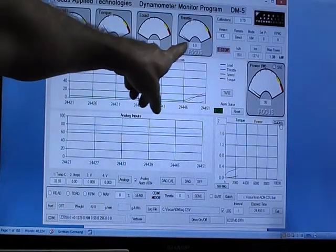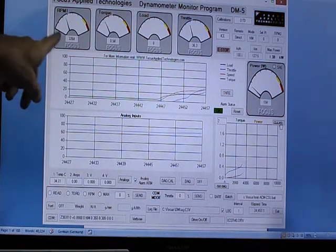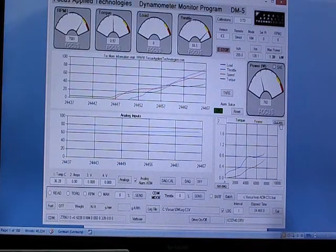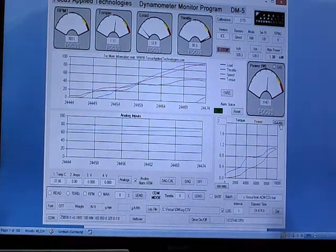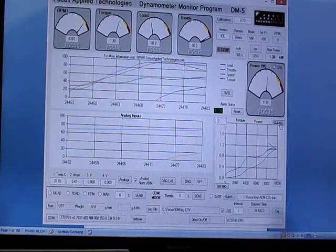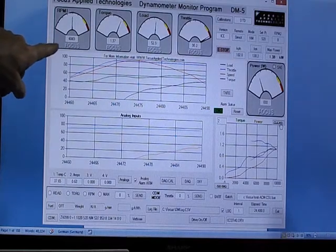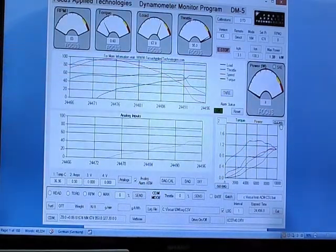We've started. Now I'm gradually opening the throttle. You can see the speed come up. We can see it at about 5,000 RPM, and the engine stalls. This is then the engine's characteristic torque curve — a very important aspect of any engine.